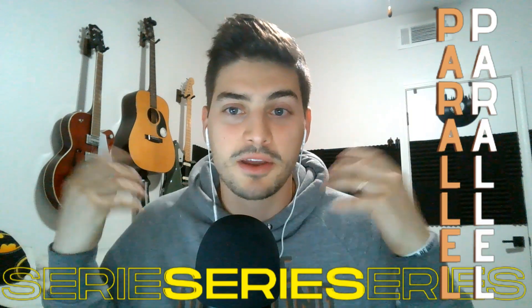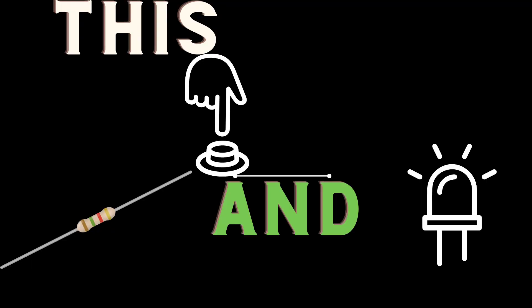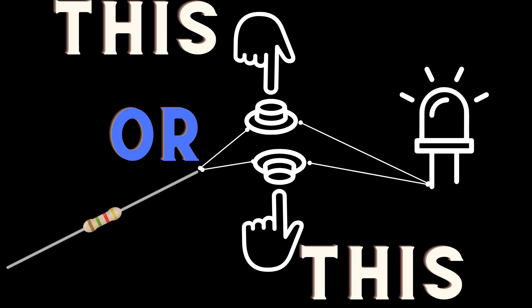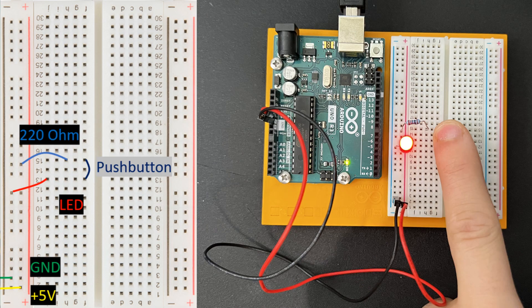Before we get into the Spaceship Interface, it's time for a quick science-y lesson thing. Everything in an electrical circuit exists in either parallel or in series with the components around it. Things in series can be considered what a programmer would call an AND command, while something in parallel can be viewed as an OR command where there's a branch and you can do either option. To look at the circuit we already built, let's see how we would add a second push button, once in series and once in parallel.